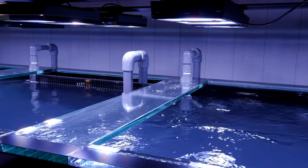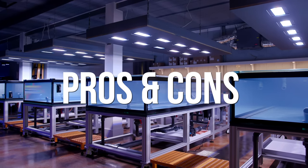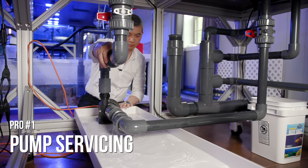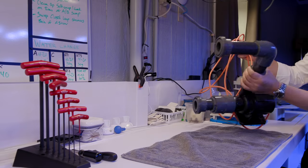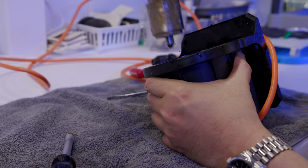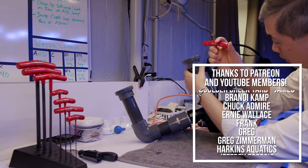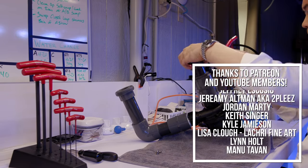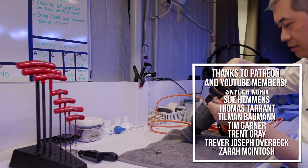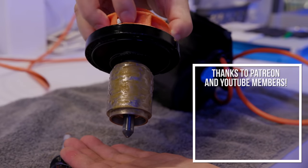This is just a very general overview of closed loops. Let's do the deep dive into the pros and cons. The first advantage that a closed loop system provides is that it makes servicing the pump a great deal easier. It's sitting right there, dry to handle, and you're only really cleaning the internals of the pump. There's nothing funky growing on the outside of it, no sneaky hiding bristle worms when you go to grab that pump — you basically just have a dry pump and you're servicing the impeller.